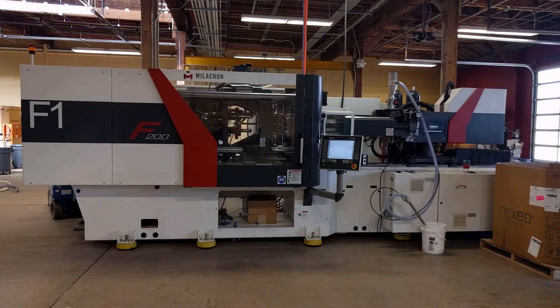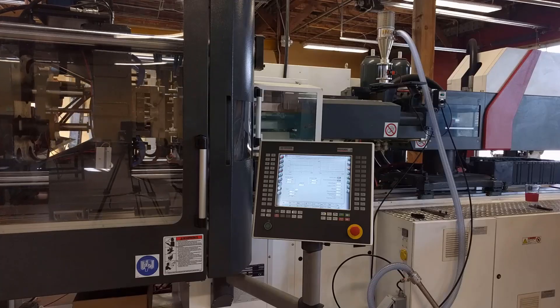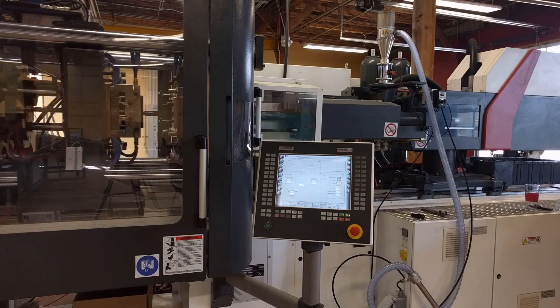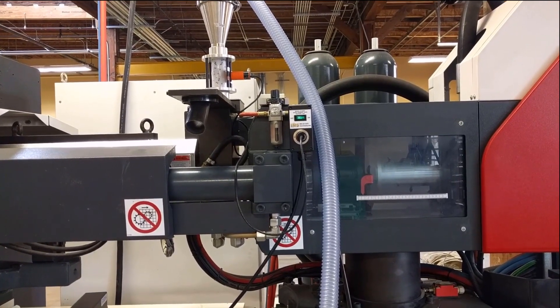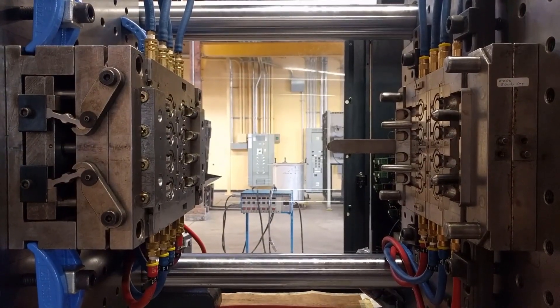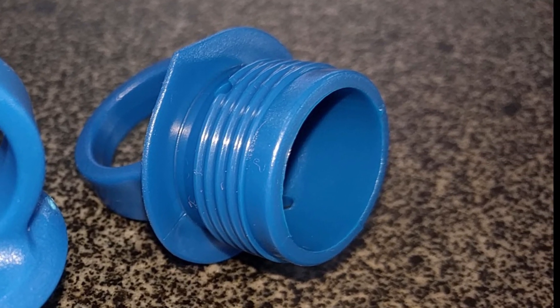So now you can see the machine in operation — mold opening and closing, the plastic injecting. I have sped up the cycle time here a little bit, but this is taking about 50 seconds between each cycle. That's the injection unit injecting the plastic into the mold and then the parts ejecting. Notice that this is an eight-cavity mold, so eight parts every 50 seconds equals about six and a quarter seconds per part. Very fast.